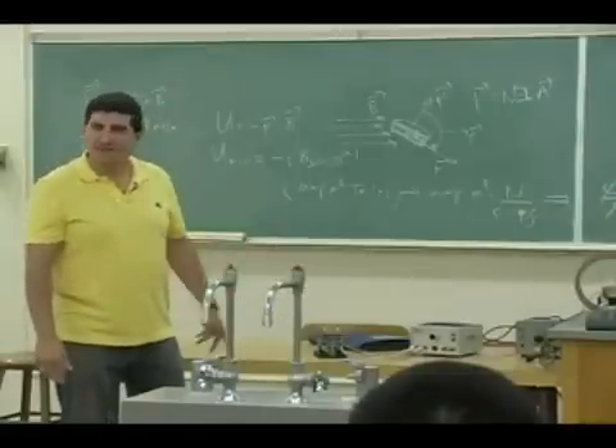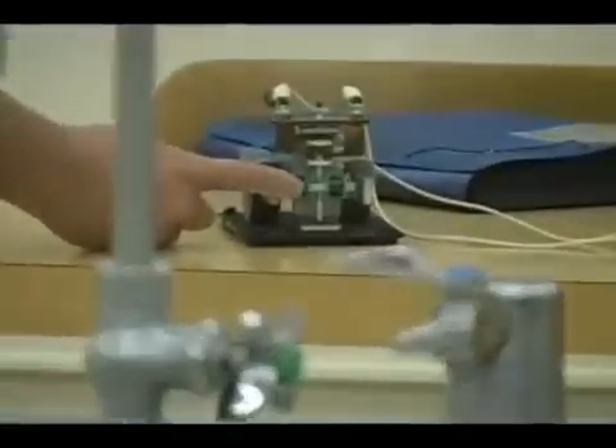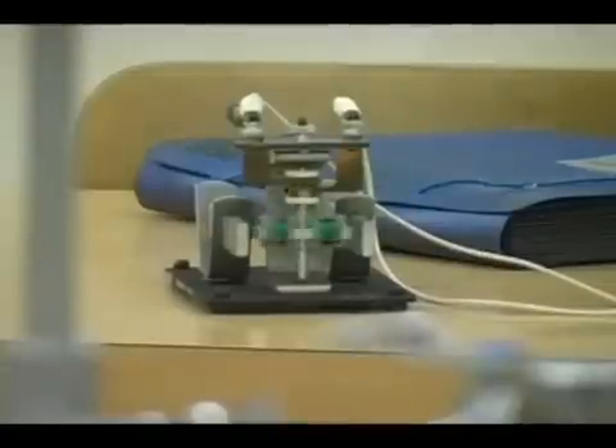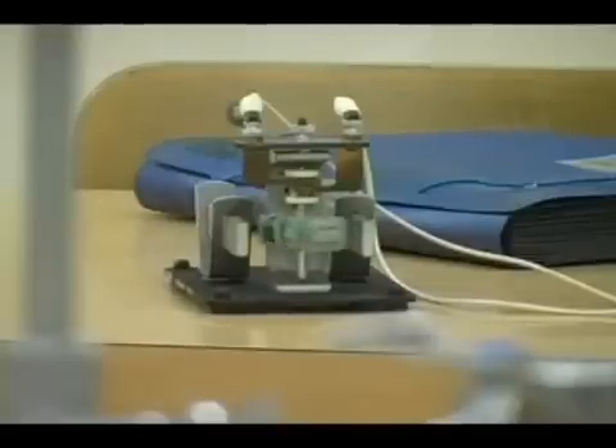So I have to give it a little kick. I come like this with my finger and give it a little kick. Now, once I give it the little kick, it does the rest, because now it's gonna start spinning. And since the current is changing direction every half a cycle, it just keeps going. And now I've created a motor from this.